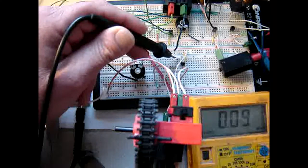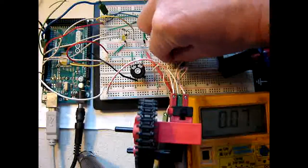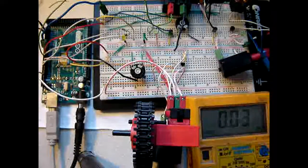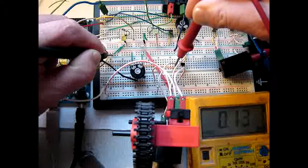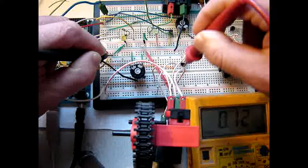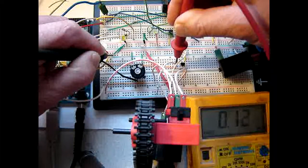So now I'm going to reroute this wire here. So let me do that. Taking it out here, and it stops. And it should actually, but now it is rerouted directly on the motor, and it doesn't work. Let me measure again. Probe on the mass. Probe here. It says nicely 120 Hertz, maybe some more. 120 Hertz, but the motor is not working.